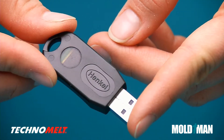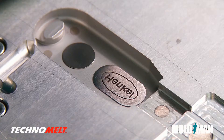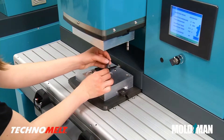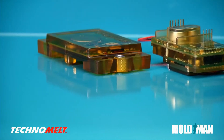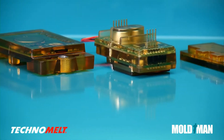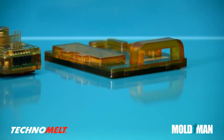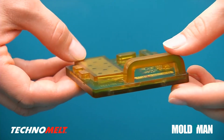This product shows two-tone over-molding protection with an LED light pipe. The logo area is interchangeable with a simple insert. This type of interchangeability is also well suited for serial numbers and model information. MoldMan machines can mold Technomelt in any shape or form. Skylining makes an efficient use of material and effectively produces lighter parts, an advantage especially in automotive products.